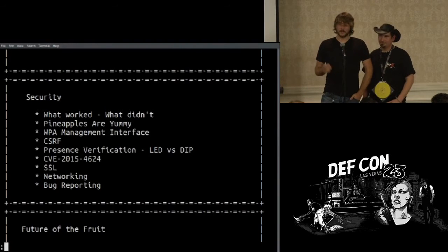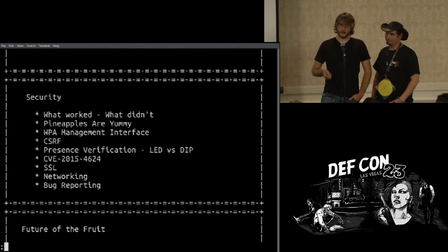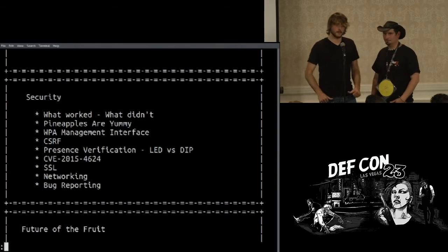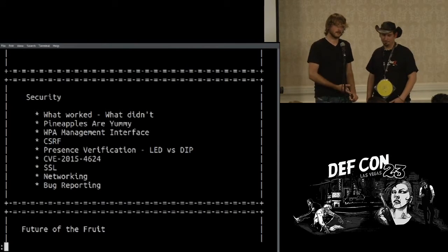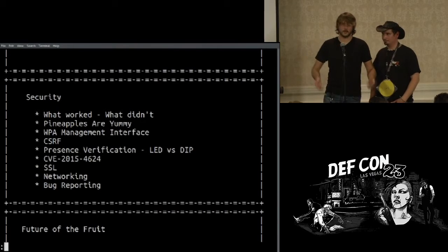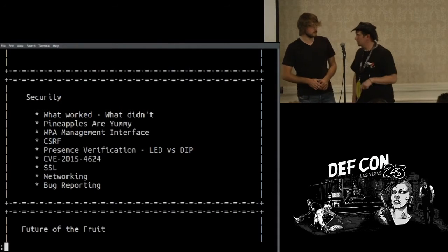But basically what we did is we included the possibility to, by flipping down the dip switches, it tells you to flip down. It'll disable the radios and then let you proceed with the setup by re-flipping them up. So that means the radios are disabled during initial setup. So it really is just you over Ethernet connected to the device. So you can set it up safely. You've got the time to do so. And you can't proceed with it unless your Ethernet cable is man-in-the-middled.